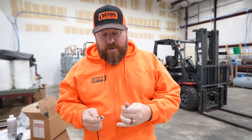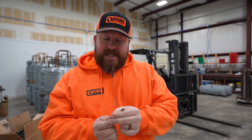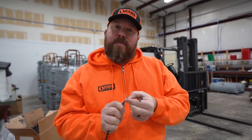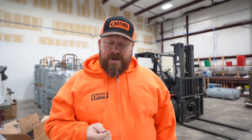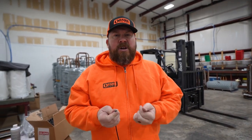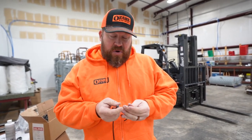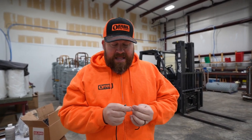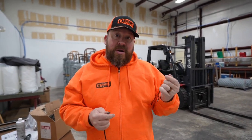Now if we're talking about ASTM, we're talking about a class one wire versus a class two-A wire. There's also a class two-B wire, which is fused and bonded — a different process. We don't have any on hand, but with a fused and bonded wire you wouldn't be able to peel this off at all. You would literally have to whittle off all of it because it is literally fused to the core, to the galvanized strand. That's another interesting point — both of these are galvanized cores. No matter whether you're buying extruded or extruded bonded, class one versus class two-A, they're going to have a galvanized core. So if it does get a nick, we're still not going to see rust. At the ends where you see cuts, you won't see rust there.